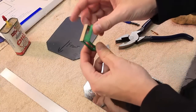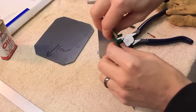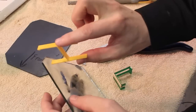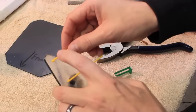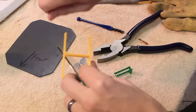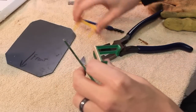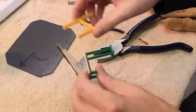Here are those little spacers — I had to glue on a little piece to equal the glass thickness. This one isn't quite the thickness of my glass, so I had to glue it on to get the right thickness. Here are the ones you can put in through the slot, but I printed some others with a thicker edge. This side should be the same thickness as your glass. My adjustment screws were totally bottomed out, so by thickening up the spacer it gave me the full range of adjustments. Make sure this spacer is the same thickness as your glass — I'll post the STL files I used for thickening it up, or you can just glue something on.